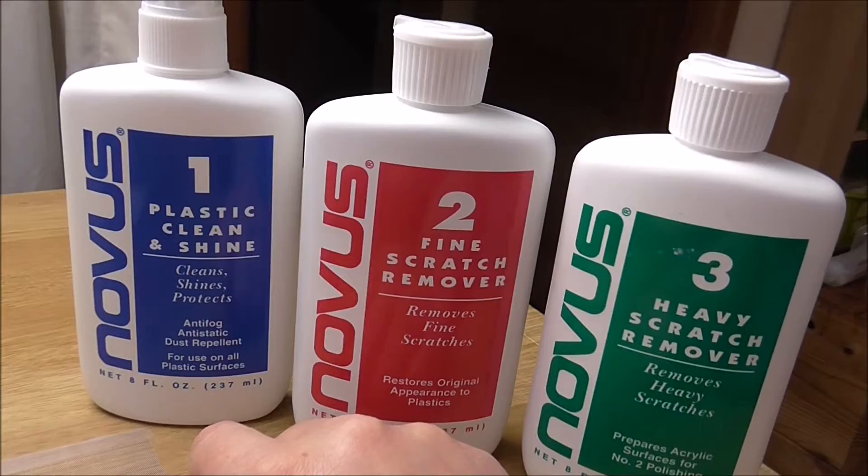Hopefully from that you can see that there are a lot of stages to sanding and polishing. What was happening was I was using the two coarser sandpapers — the red paper ones — and then moving straight on to the polishing and buffing creams. It wasn't getting rid of all the deep scratches, so I could still see scratches on the surface of the pieces. I've now sourced some new paper and I'm really pleased after working with it today to see that I can get such a brilliant shine on the pieces.